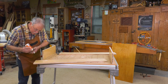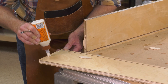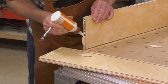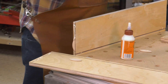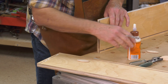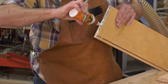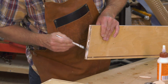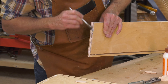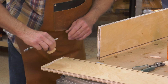Bring that glue up here — just the right amount. And what's my favorite glue? It's water-based wood glue, yellow aliphatic resin wood glue. It really doesn't matter to me what brand as much as just using the right amount of wood glue, brushing it out, sizing the joint, prepping it.